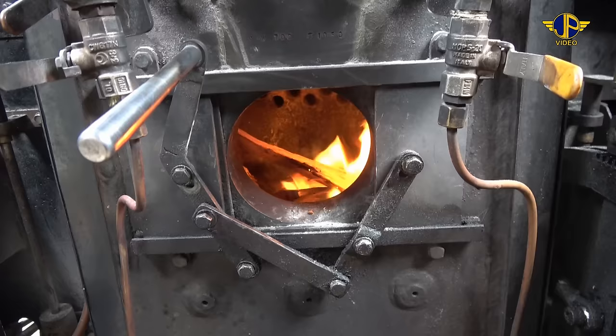If we didn't have steam in the boiler, that would be a still level. Because we've got water that's boiling, and we've got this convection current affair happening within the boiler itself, the flow of water within the boiler, it's just a natural occurrence. We actually get a differential in movement of water inside the gauge glass, and it's the same evident on both side gauge glasses.